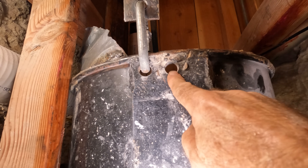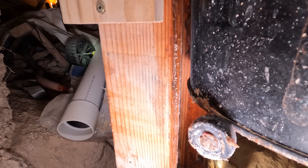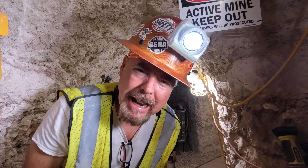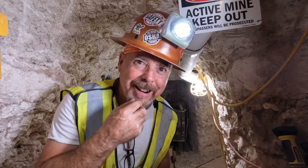This hole is in the very center of the 30-gallon drum, and this one is offset to the front. If it's an inclined shaft, it's not a big deal, but on a vertical shaft you want the lip of that skip bucket to sit out — that's what these two holes are for. When you fill that thing up, all the weight transfers inside and pushes the butt to the rail and the lip away. This is really an easy way to do it — if you can weld, it's super simple, but you can bolt these together too.